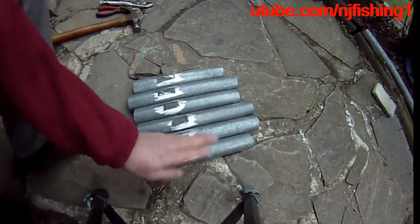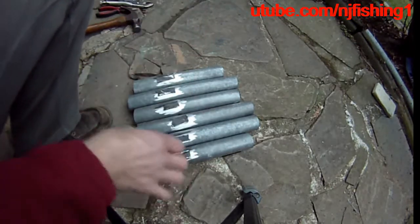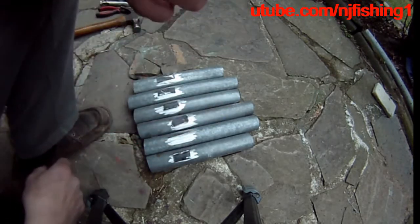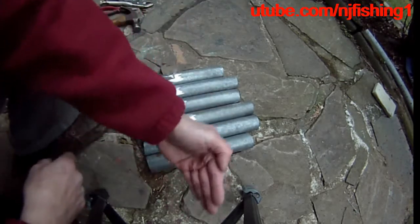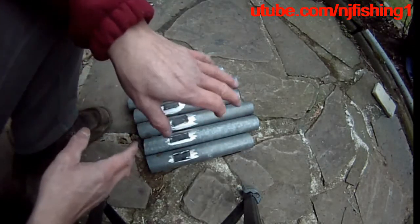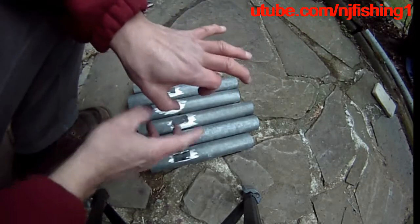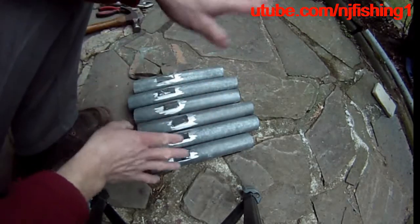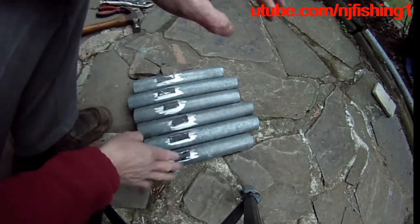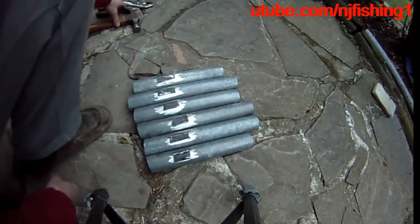Because the surface is contoured — it's a curved surface — it's very difficult to weld these six round tubes to the horizontal tubes. You need to cut a piece of flat metal and then you'll be able to weld these six rods onto the other horizontal round galvanized steel bar. Round tube to round tube is very difficult to weld because both surfaces are curved. It's almost impossible unless you create this kind of flat plate sandwich in between the two round tubes to create more weldable surface — much easier, especially for beginners.